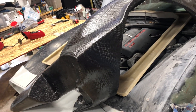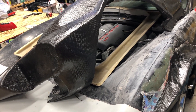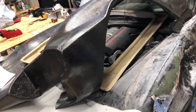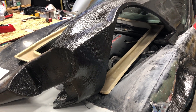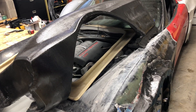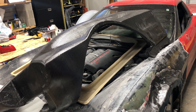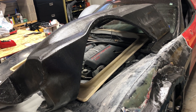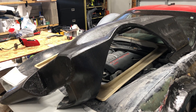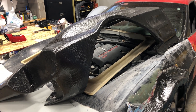That brings up the question about strength and how much vacuum helps. There are several tests I've looked at, and the bottom line is by using just vacuum bagging it provides about a 4% strength increase over doing what we're doing now. I don't really think it's worth all that money for a 4% strength increase. Now if you go to vacuum infusion, it gives about a 33% — about a third — increase in strength. So that might be worth the money, but still $1,500 — I'm trying to do this shade tree style. For most people, $1,500 is a lot of money. People in the carbon fiber group said just go ahead and go to vacuum infusion, the stuff isn't that expensive. But $1,500 to me isn't cheap — there are a lot of things I could buy for $1,500 instead of all this vacuum infusion equipment.